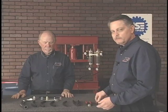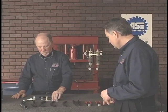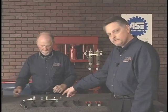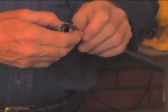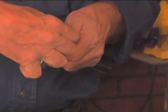We're going to be crimping the number 8 size, which is the same size that we crimped on the ATCO bubble crimper. John, if you'll go ahead and assemble the ATCO AN fitting, which is a new fitting for this year. It's one-piece, non-brazed. The fitting simply goes inside the hose, bottoms it out.